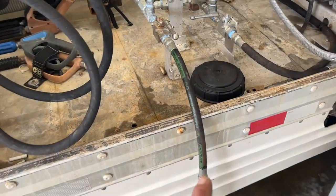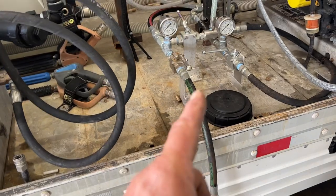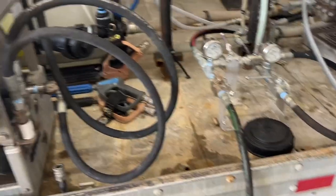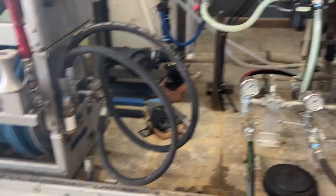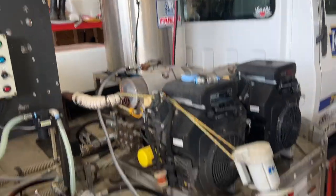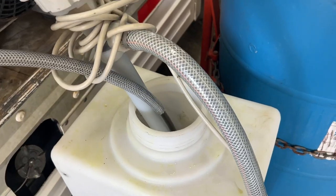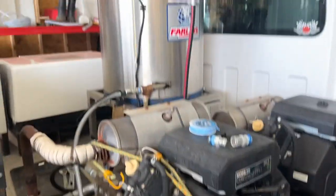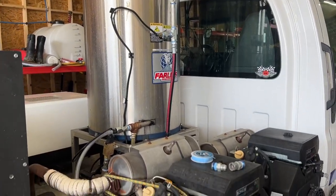Love the whips. Instead of going with your hose right into something hard, when you let off the gun these things jump and they do break off. And if I want to use the hose reel, I just hook these jumpers into it or just strip it off and put it right on. But this is how I flush my hot water burner — real easy. Within a couple of minutes, done. Because if you don't make it easy, you're not going to do it. Hope this helps you out. Keep on spraying.